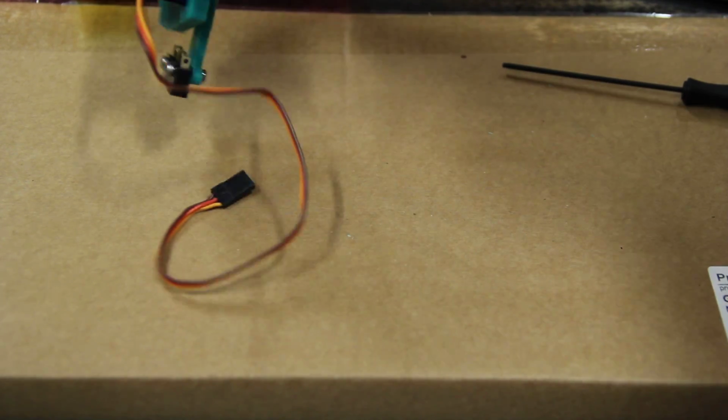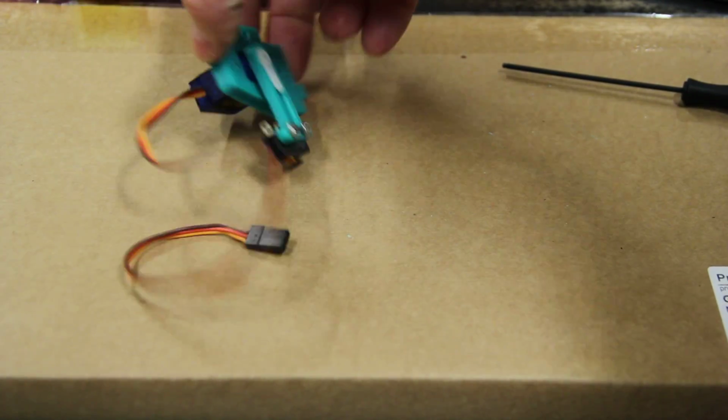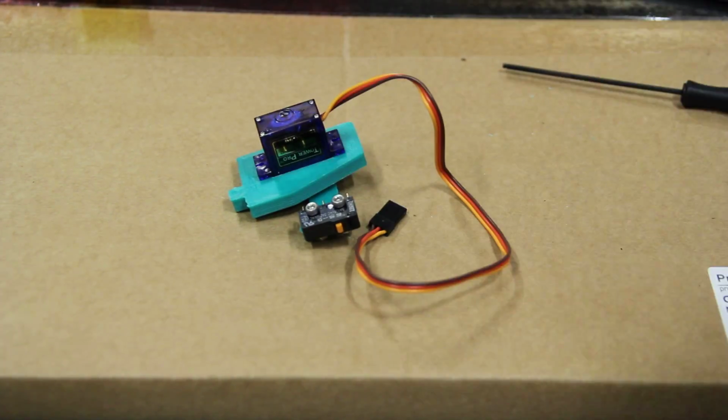And then now you've got the hardware set up, and in the next step we'll be talking about how to modify your Marlin firmware, because the standard Marlin firmware that comes from Makerfarm does not include the auto bed leveling feature, and the standard Marlin, which you're going to download from the Marlin GitHub, is not set up immediately for the Makerfarm Prusa i3. So we're going to have a lot of configuring we're going to need to do, and that's going to be a separate video. So that's coming up very shortly.